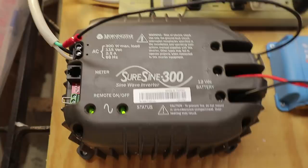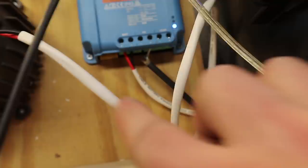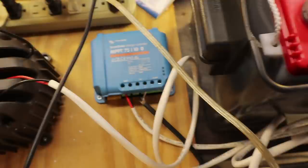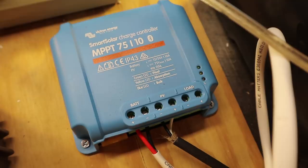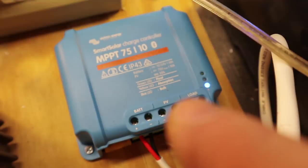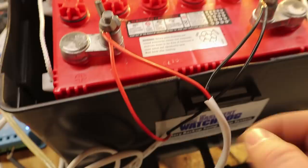I have another cable plugged in there that runs out and will be connected to the water wheel — that's an AC wire. All the rest of the stuff is speaker wire; I didn't have any DC wire laying around. The way this is set up, you can do a load straight off of the controller, which is probably best for a DC load. However, this controller does not like capacitive or high-inrush inverters, so connecting this inverter to it wasn't working — it draws too many amps on startup. So I had to connect the inverter straight to the battery, and this other lead goes to the charge controller.